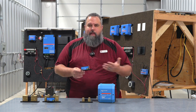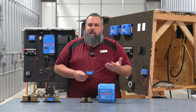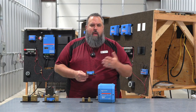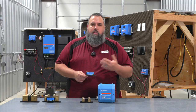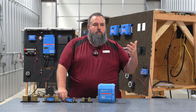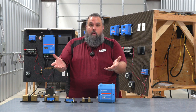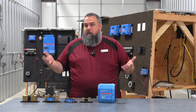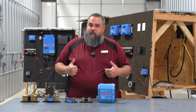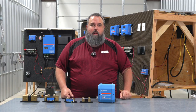Just like any electrical device, every once in a while they can get off. So I always recommend — tell your students, tell your customers — once a quarter, meaning every three months, get out in nature for a night, plug into shore power, get your batteries fully charged, and reset that state of charge. It's crucial, because if not, your batteries might be reading one thing but what's truly left in them might be another. You don't want to be boondocking out in the middle of nowhere thinking you've got battery life left when in reality everything goes dark. In this heat, I don't want to be in the dark with no air conditioning. My rule of thumb: once every three months, plug back into shore power and let that state of charge get reset.